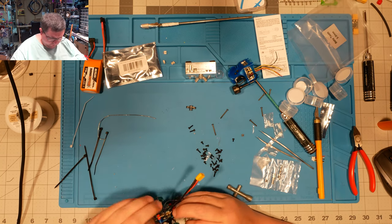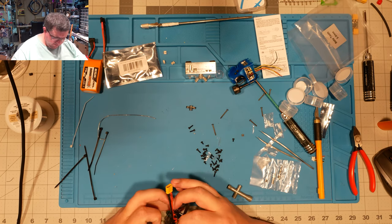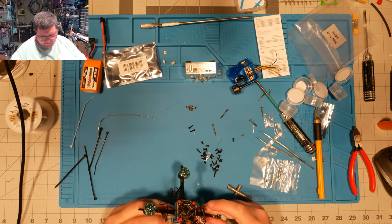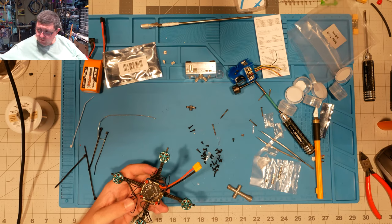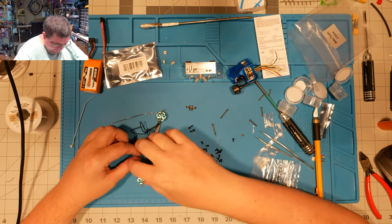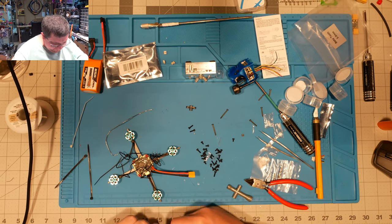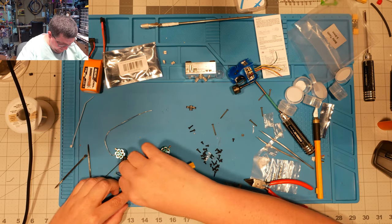And I use the DJI controller with all my DJI gear. I've tried Crossfire on my DJIs, and I found that there's a disconnect for me. What I'd call sync lag. So the things my quad is doing, I'm seeing the reaction of my inputs. If I do a roll or something like that, I'm watching it happen in the goggles, and I am not seeing the true representation of my stick inputs. And so I overshoot a lot and have to make a whole lot more corrections than I do when I run with the DJI unit.